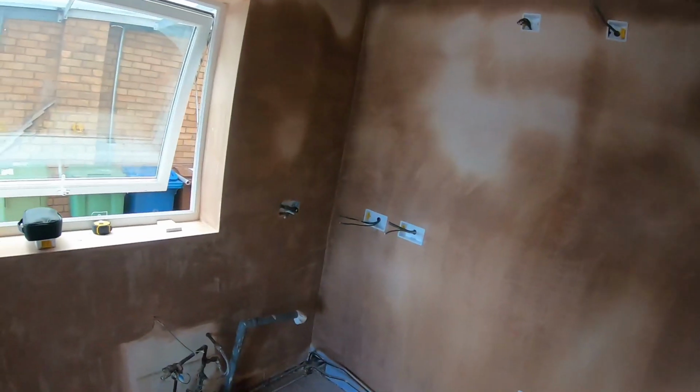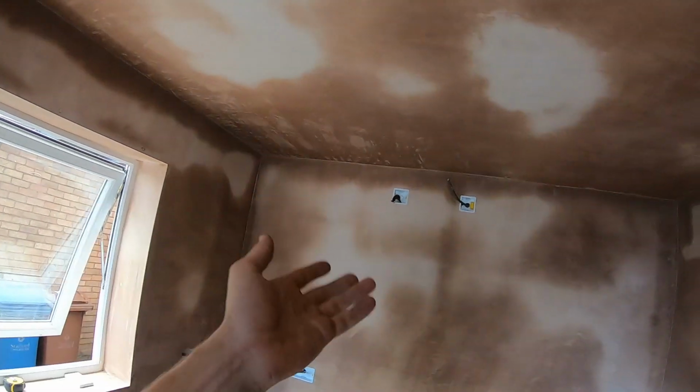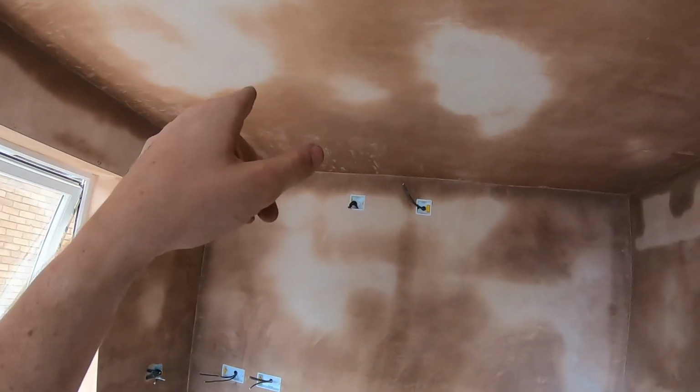So, kitchen plan, so we know it's worktop 600, 600, 600. Normally I just mark 600 square on the ceiling as such, bring it in 100mm each way, so we've got a little bit of light that comes down on the angle. I think we're putting 6 in here or 4, I'm just going to double check. So yeah, I'm going to pencil that up and then we'll cut them out.